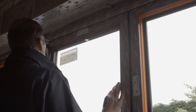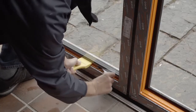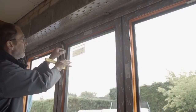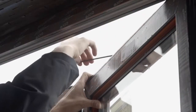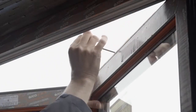Once the glass unit is in place, pack the glass over the bridge packers with additional packers at hinge and lock points. Be careful not to overpack the sashes, as this can cause swelling. If the door has a toe and heeling device, you can tighten this as needed, but don't over-tighten as this can cause damage to the glass unit.